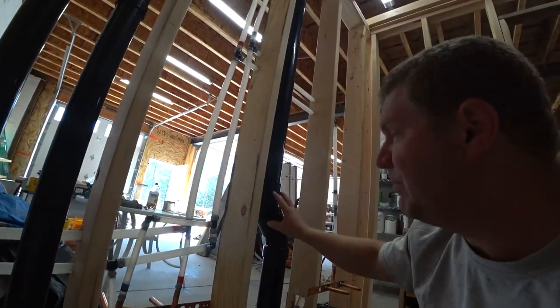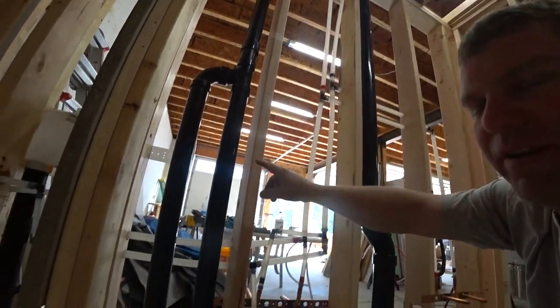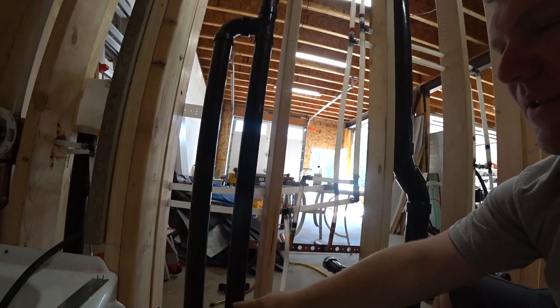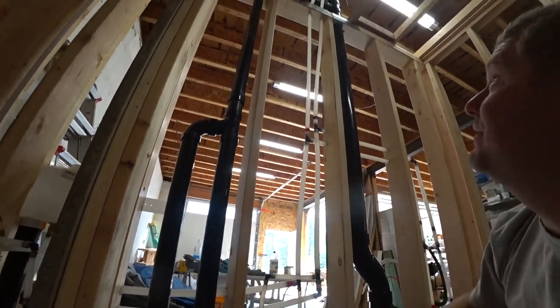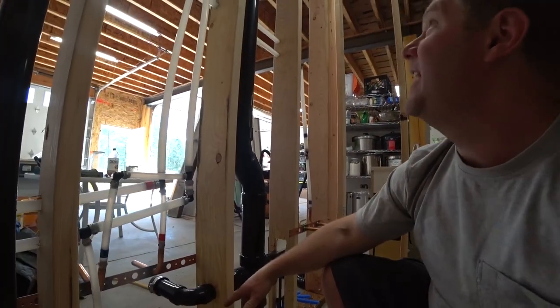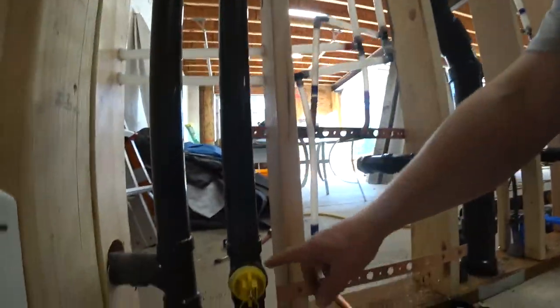Don't hear anything going past our balloons yet. This pipe will actually fill first, the main pipe. And then when it gets clear up to that T, it'll come over here and fill these vents. So these will be almost the last to be filled. And then once all that's full, she'll have to fill just the vent pipe. If these caps are gonna blow, they'll blow early, and then it'll save us from making a mess over there. But I've gotta wait to listen to these balloons here, because if any water's getting by them, of course she'll never get the system full.